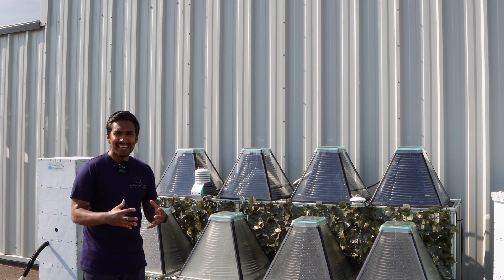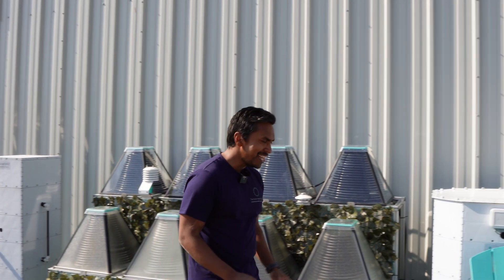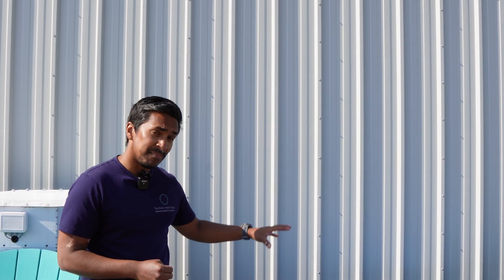For all of that to work we obviously need a pump to circulate the water from the swimming pool through the solar collectors. What's really common with these above-ground swimming pools is to use the filtering pump that's quite often purchased alongside them. From our experience those pumps tend not to have too much power, so if you try to couple that pump with solar collectors the flow rate can really drop and hinder the cleaning process. Our recommendation is to leave the filtering pump untouched and install a separate pump for the pool heating side.